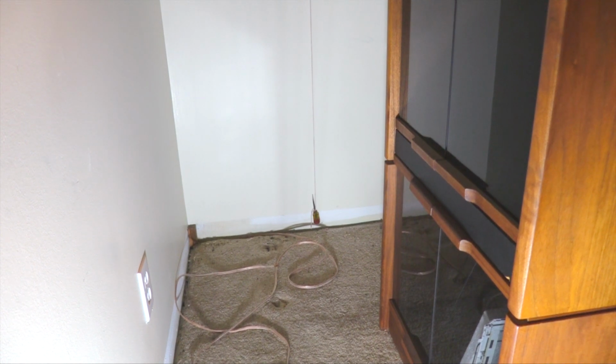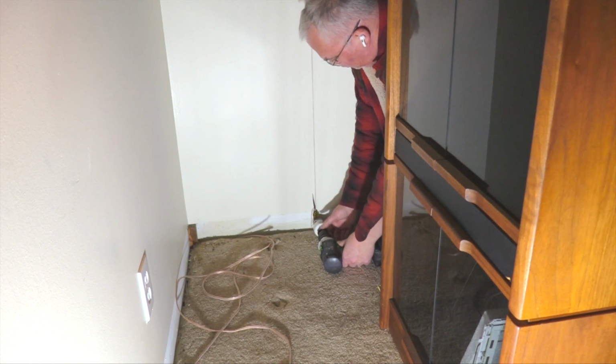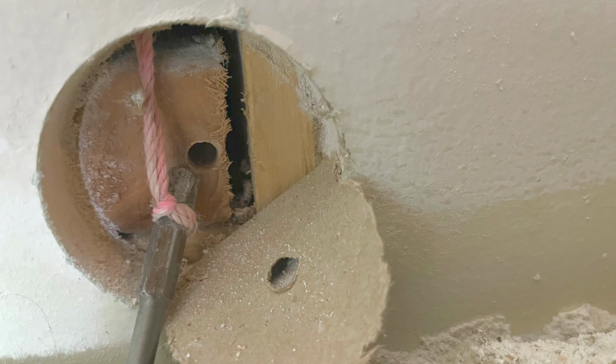To mark my exit hole, I tied an awl to my string line and used it as a plumb bob. I marked the hole and punched it out with a drill. When I removed the plug, I found they added a patch block to the sill seam. I was still able to pass the speaker wires through the restricted opening.